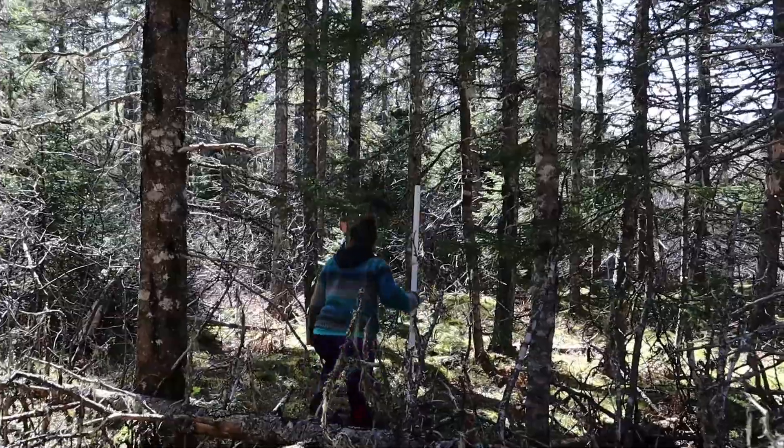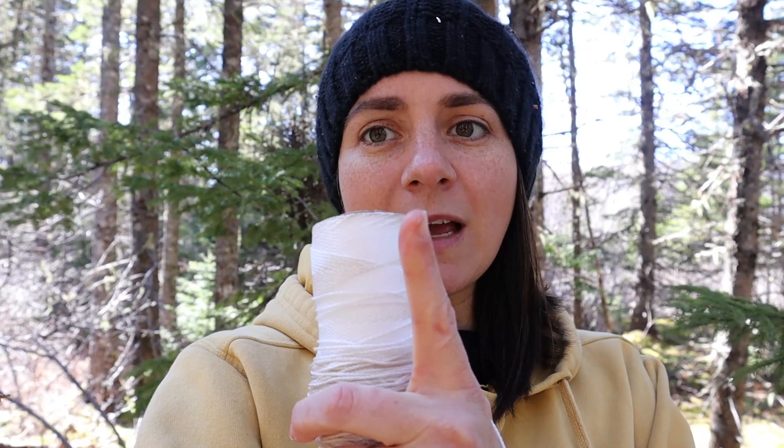What's happening is that Dominic keeps cutting lines, but the two posts are so far from each other and there's so many trees in between that no one can tell how to connect the two points without seeing them. So we keep going off in the wrong direction - that was like the fourth or fifth run through. So we're going to try to put a person at each point and somebody in the middle to communicate with each other: if one person's at point A and one person's at point C, we're going to have someone place themselves as point B, moving around until they line up between point A and point C.